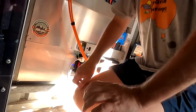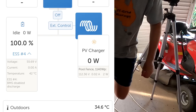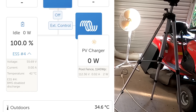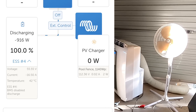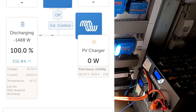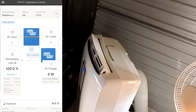Air conditioning is plugged in - let's turn it on and watch the VRM. 33 watts is the standby power of the inverter, which is a lot. I turned it off and it goes to zero. Now turning it on - the aircon is running! Discharging 1.1 kilowatt, 1.3, 1.5, around 1.5 kilowatts we are pulling through our inverter from our batteries.